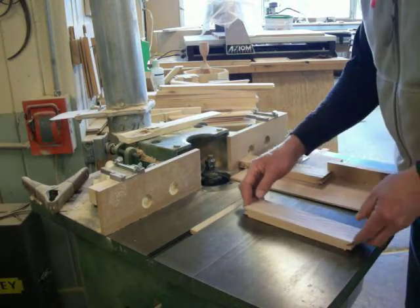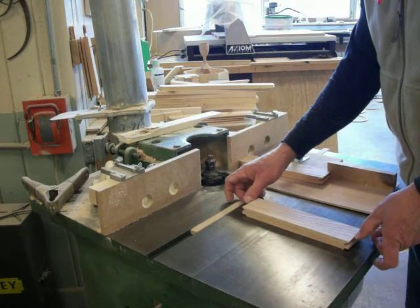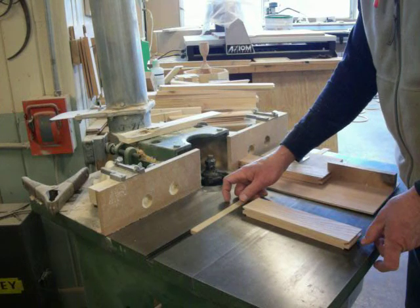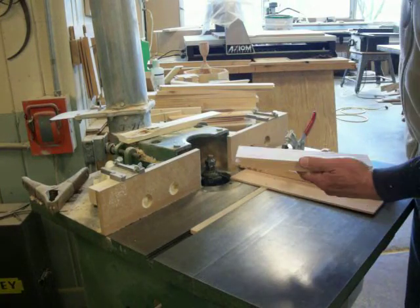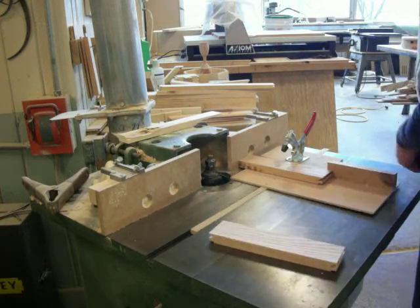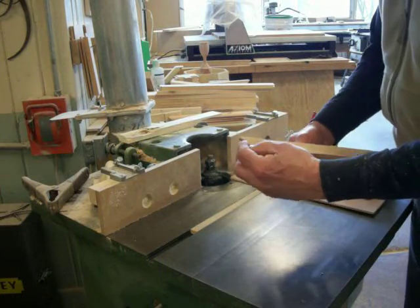So what I ended up with, I have 2 1/4 inch stiles and rails. So 2 1/4 and 2 1/4 is 4.5. 13.5 minus 4.5 gives me 9. And then I added the 3/4 here. So that's what I have here on these rails. These are 9 3/4. And as you can see, I just have them a little bit heavy, about a 1/16 of an inch heavy.